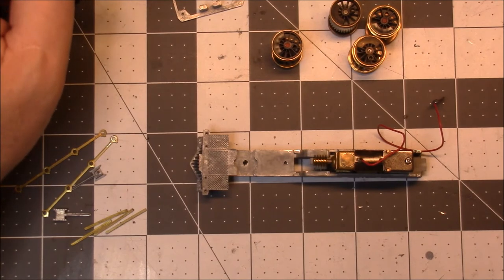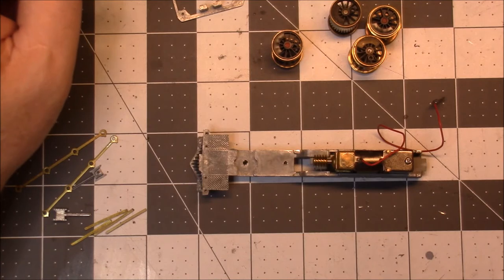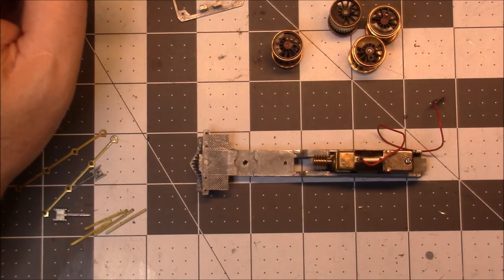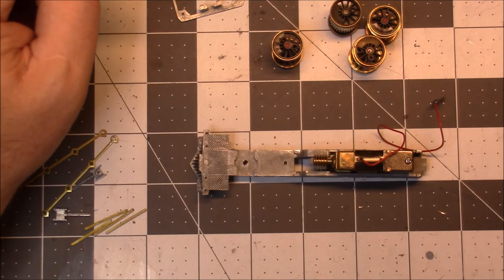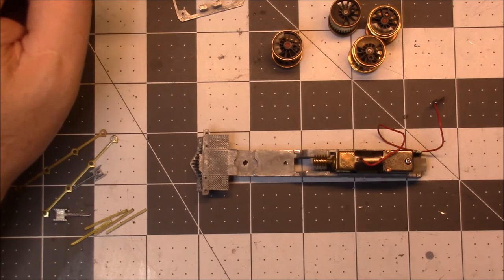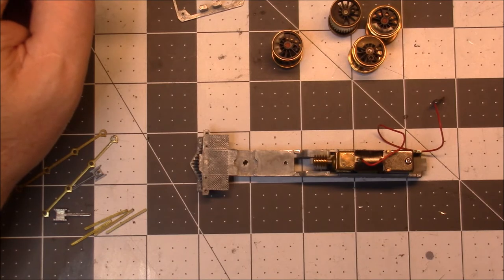Okay, there should be a very slight amount of play between the worm gear teeth and the step gear. Tighten the motor mounting screw and rotate the armature with your finger, making sure there's no bind. Check over the relationship of the motor worm gear and the gear mesh of the step gear. If the teeth are binding, you may need to shim up the motor slightly. Please place a piece of notebook paper under the front of the motor and recheck.